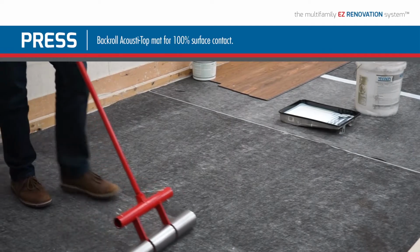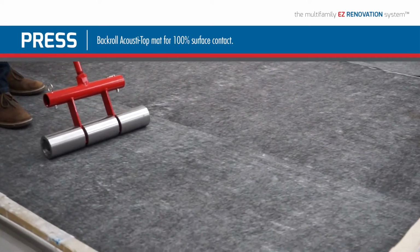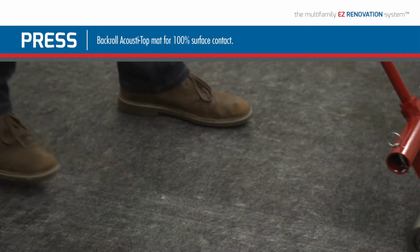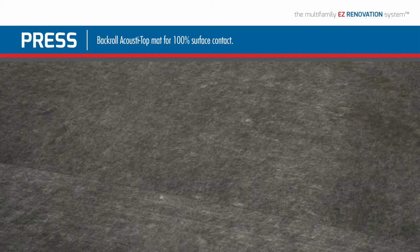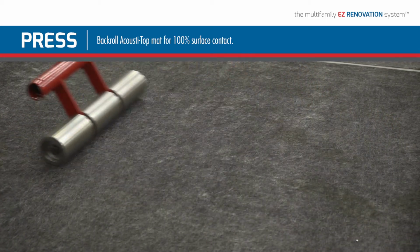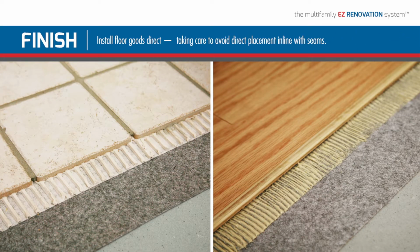After Acousti-Top strips are placed, backroll the mat with a standard resilient floor roller to ensure 100% surface coverage is achieved. Ensure that no air pockets or folds have resulted from backrolling. Roll perpendicular to direction of floor goods. Acousti-Top is compatible with a variety of floor goods and adhesives. Follow floor covering manufacturer's adhesive and installation guidelines.